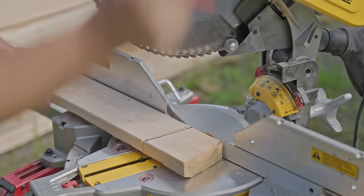If you cut this off without looking, and let's say I cut it right here, there's my knot. I throw my first nail in, the nail's going to hit that and bounce it open, and you're not going to be able to even use a screw to drive it closed, right? You're going to have to pull out that nail, pre-drill a hole, and throw in a screw. Such a pain in the butt. So pay attention, right? I'm good here.